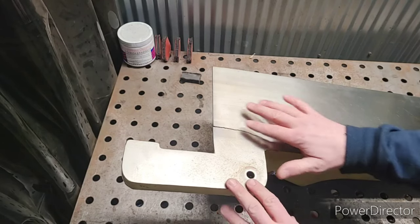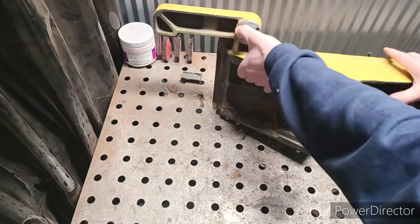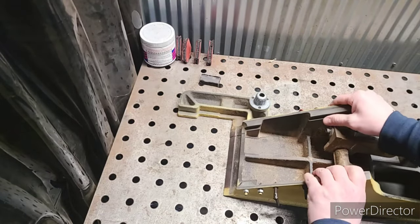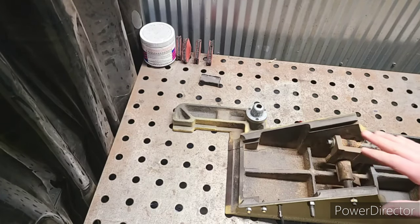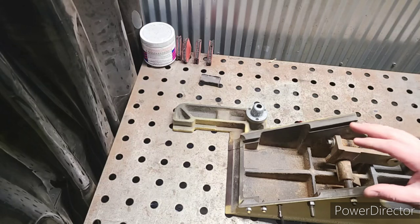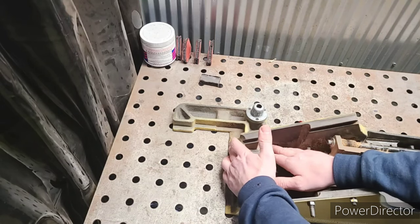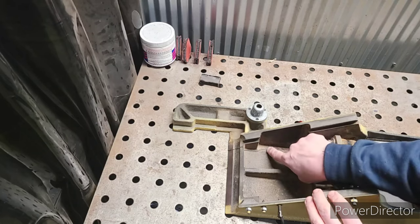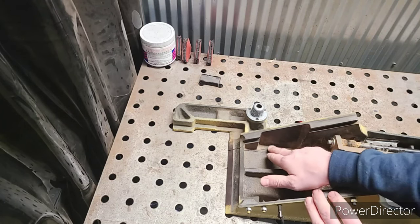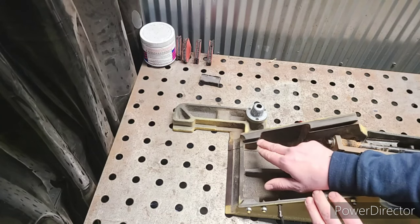Here is a close-up view of the break. As you can see, the crack runs along right here and stops about right here. If we turn it over, you can see how this crack runs all the way through — from here all the way to here. Now, one other unique property of cast iron is that while you are heating this up, there is always the chance that this part will crack further. So what you need to do is find the ends of your cracks and drill a relief hole. All this hole does is prevent that crack from spreading any further. I'm going to drill a hole right here in the corner so that if this crack continues to travel, it will hit that hole and stop.